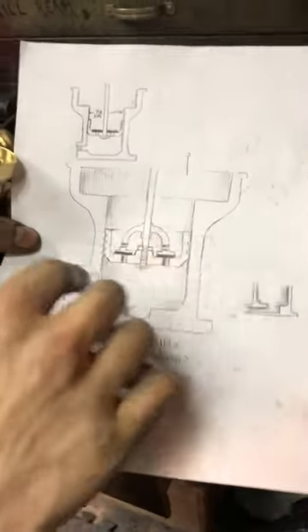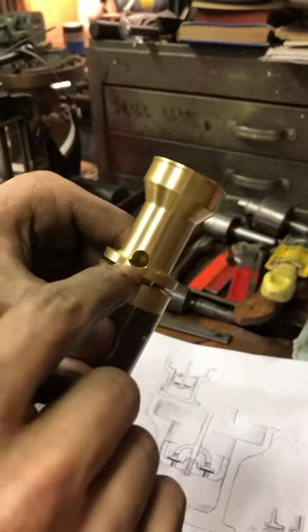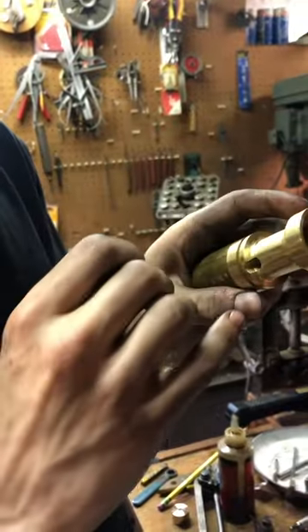This would be if the pump is short-stroke, but this is the bottom port, and that's what I did. I cross-milled right through there, and in there, and there's a piston in there. This is the bucket piston, which is also going to be a check valve. There's the bottom port and the cross port.